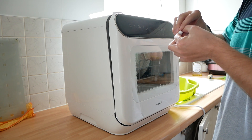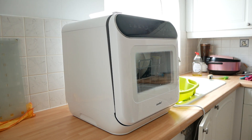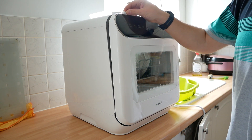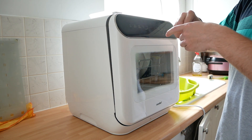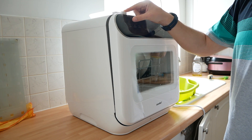I could also experiment with a contact sensor. However, we are back to problem one — opening and closing the door multiple times throughout the day would trigger false positives, so you would need an additional trigger. And let's face it: if you need to remember to arm the notification, it's probably not worth it.